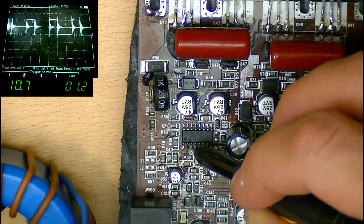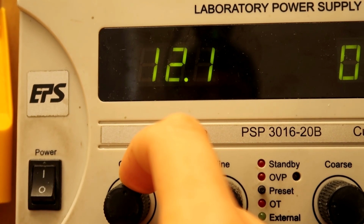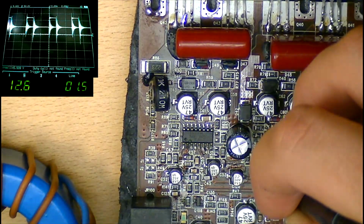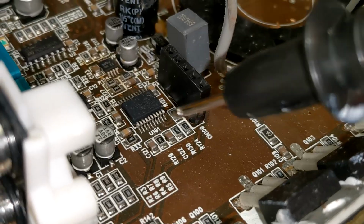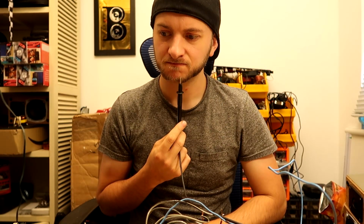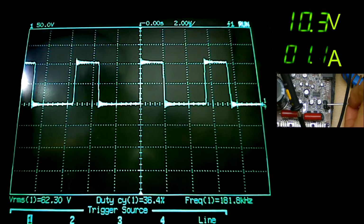So I started probing various points on the output drive circuit while the amp was powered up and varying the voltage level so the duty cycle changed, and I looked for some kind of changing voltage that moved with the change in duty. Nope, no luck here. Everything stayed the same, regardless of the rail voltage level. I considered whether the PIC might be responsible, as it might be programmed to change the duty with a rail voltage level, so I varied both the rail sense and battery voltage sense pins with a potentiometer, which made no difference to the duty cycle either, so it wasn't the PIC.